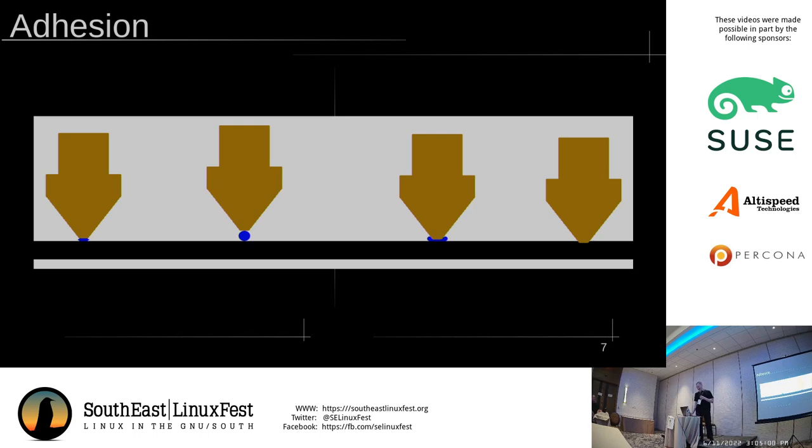I'll be doing a run through of a bunch of different plastics. Generally speaking, if you print PETG, you'll be putting down Kapton tape, especially if you've been printing PLA beforehand. And some plastics just will not stick to just about anything — there are ones that you have to print a sacrificial layer of something, and then print on top of that. Those tend to be really exotic stuff.